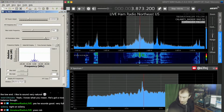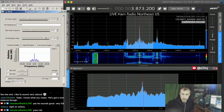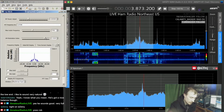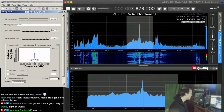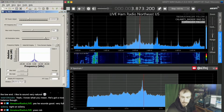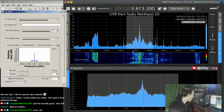Well, I got an amplifier that I built for the car using 4 FETs, the modulator FETs, the IRFP260Ns. There's 4 of them, and it does 250 watts carrier. It's kind of brutal, but it's amp hungry. It wants to run around 35, 40 amps.